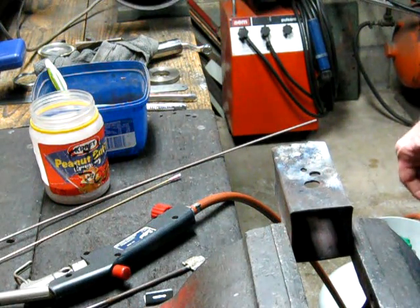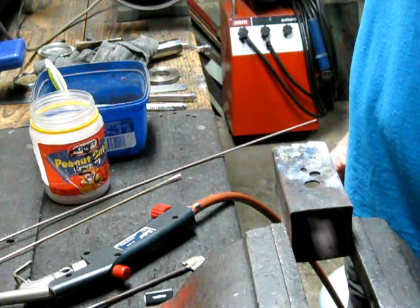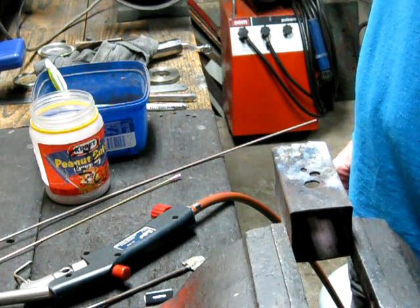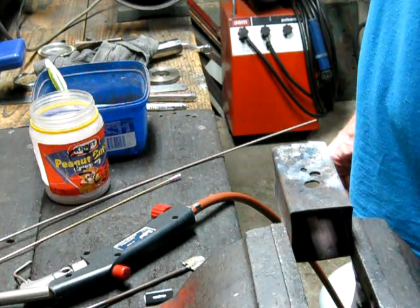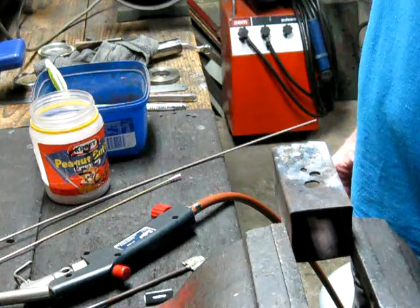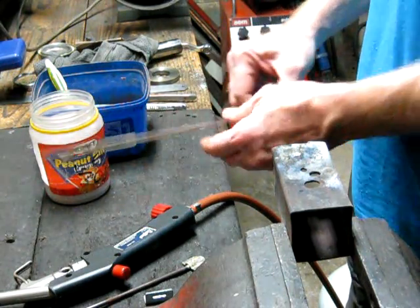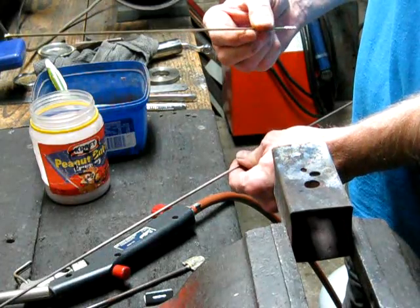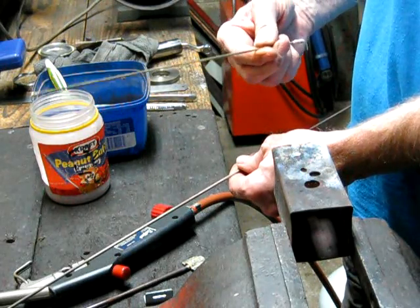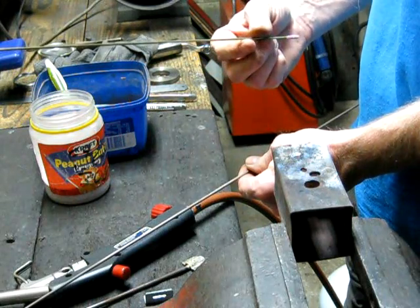In this video I'm going to give a demonstration on how you can do hard bronze brazing up to an inch in diameter in your home workshop using a standard LPG gas bottle. Hard bronze braze is this stuff — this is the sort of stuff you would normally use with oxyacetylene, but as I said, you can braze with LPG.